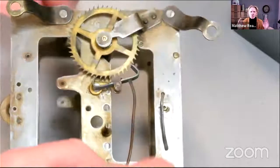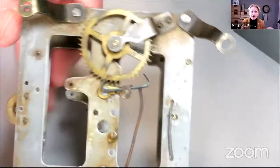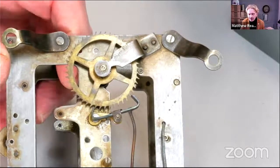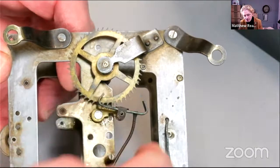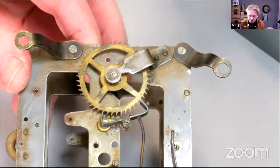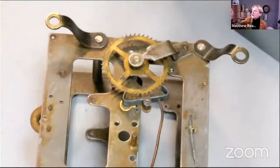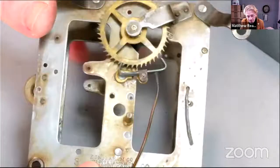Good, okay, so it doesn't matter whether you're working on a 1720 clock by George Graham or whether you're working on a clock like this. To me, it makes no difference. The principle is the same, and the principle of the approach as well is pretty much the same, I would say. So the usual story here, we've got a cost-benefit exercise going on in terms of the change to the object. You can see that heating the pallets has changed the color of the steel. It's also changed the color of the brass here, and it will have slightly annealed these little bushings. So I could replace those, or I can leave those to the next person when it finally wears out. There is already a little bit of shake in them, but not too bad. So is that cost of change more or less than the cost of making completely new pallets, and so on and so forth? So a kind of point of discussion that we enter into with all our processes like this. But really happy with that.